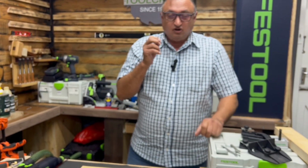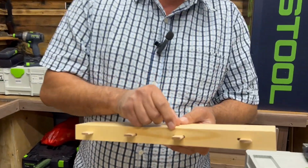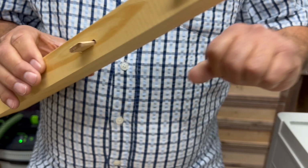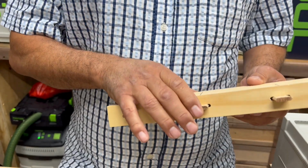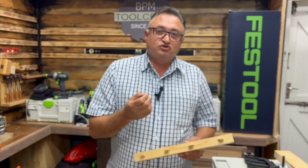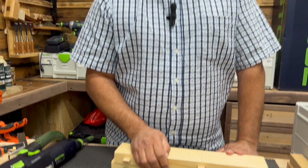Also remember that the domino that you're using, because of the depth that you're cutting in, gives you 5 times more strength in joining than when using a biscuit. So the domino is a stronger joint. And you can use the thicker dominoes as well, if it's a very thick table or very big piece of wood that you're joining. The bigger the domino is, the stronger your joint's going to be. Also, the dominoes are made of beech. As soon as you apply any moisture to that, the domino expands and it will make that joint a hell of a lot tighter as well.